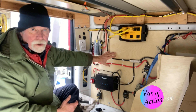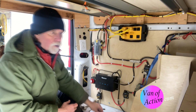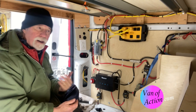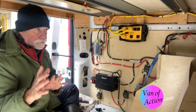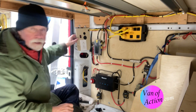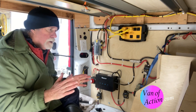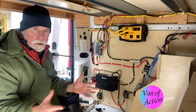I didn't get the plumbing done either. A big question about whether or not you need an inverter is going to be what are you going to use this type of power for? We have 12 volts going to service our lights and USB chargers and that kind of thing. In our particular case, we need that power to run our hot water tank and an induction cooktop for cooking inside the van, and I suppose for charging a computer. Those are the only three things that need to plug into regular household current. We also brought along a small 1,500-watt space heater in case it got cold — thinking if we're plugged into shore power, I can plug that in as well.